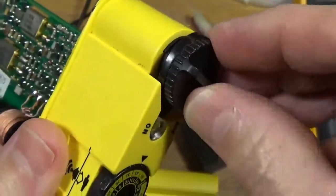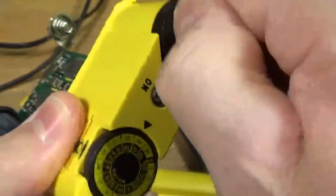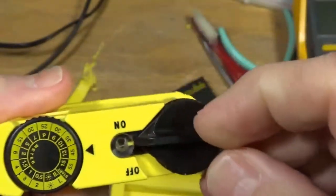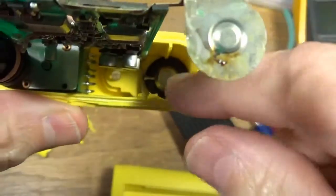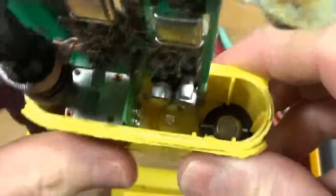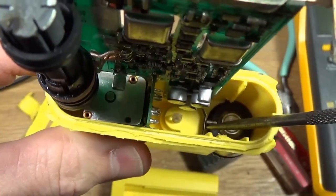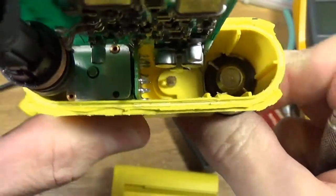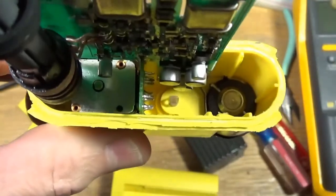It also functions as a switch, so when you put the batteries in and you lock the cover, there it's locked, but it's not turned on. And then you turn it to the next position and it actually turns it on. And what that ends up doing is, you can see inside there, there's a pin on the battery cover. Let's get something to point with right there. And it contacts this little piece of metal spring here. I'll turn it off. You can see how the contact goes away. And then the top of the battery is touching that terminal there.